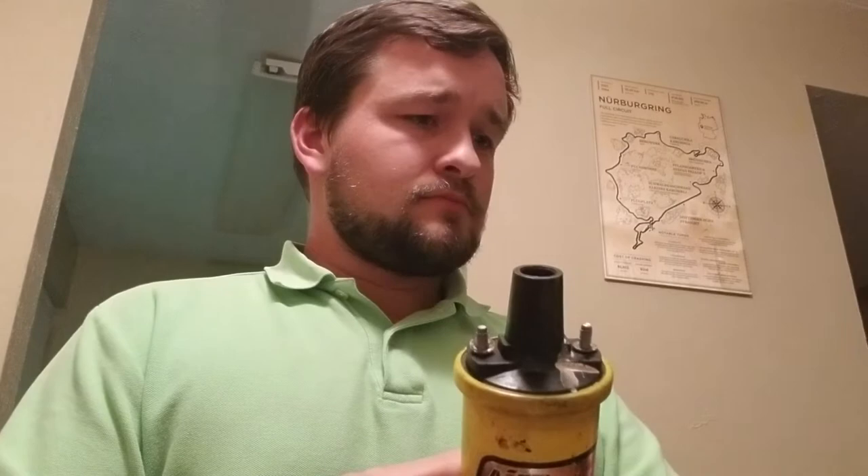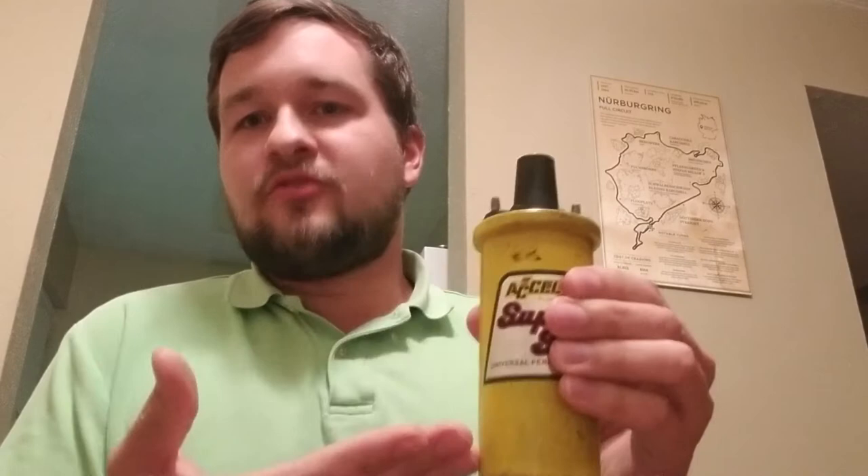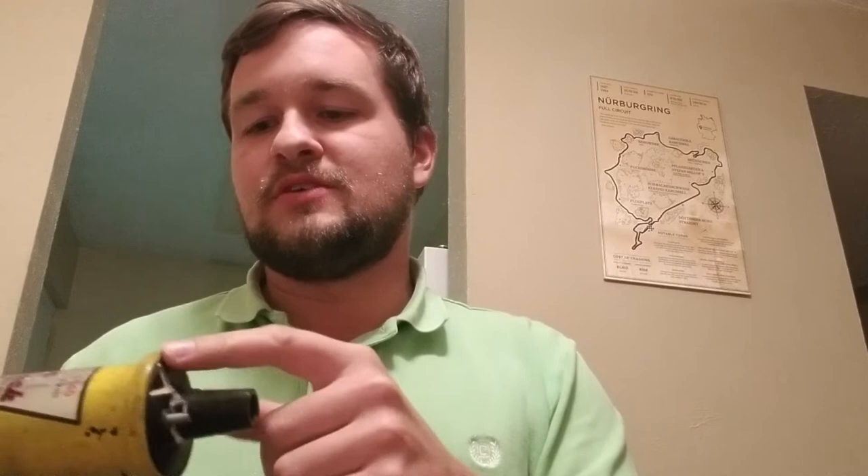With the horizontal mounting, it's actually leaking on my fingers right now. You don't want to mount something liquid-filled horizontally — it's got a press-fit cap seal with probably a rubber seal underneath, but still, you run the risk of it leaking over time and causing the coil itself to fail.